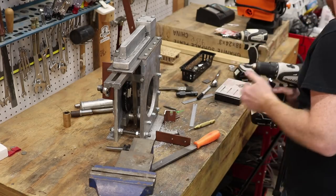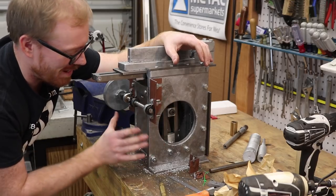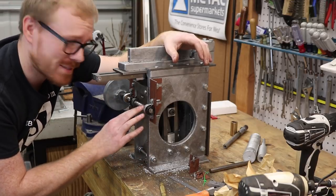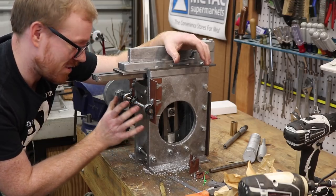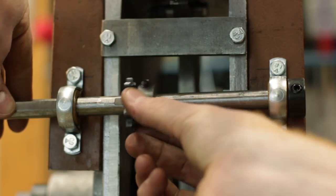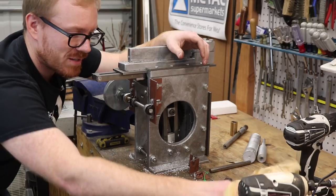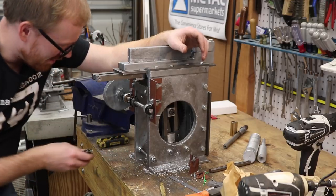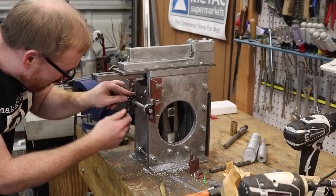Now is the moment of truth. I mounted up the brackets that hold the bearings, drilled and tapped the side castings, and mounted the bearings. I ground flat places on this rod for the set screws, and then I installed two shaft collars and installed the pinion that I bored, as well as a pulley. So now I am going to take a crack at installing the chain — let's see how this goes. The moment of truth is upon us.